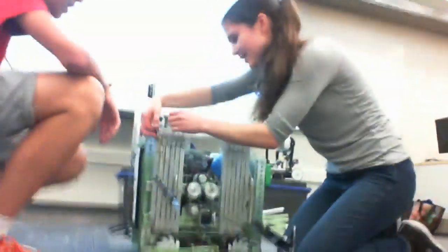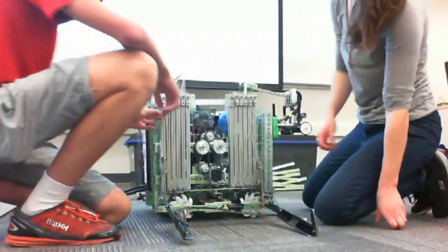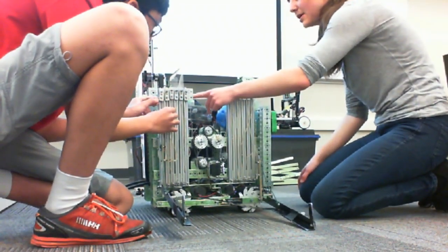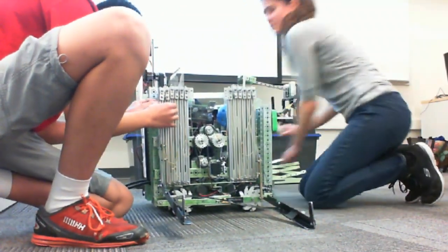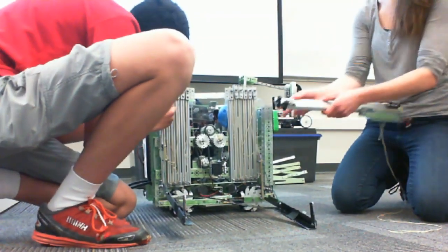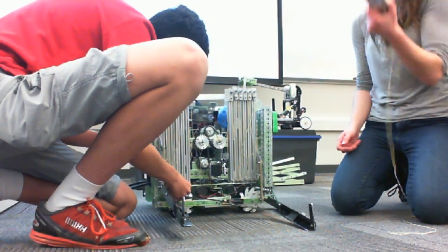Adjust the camera. This has gotten caught between the pulley and the side end. But most string things now have the caps, right? Yeah, so this one, as you can see, we got our own ball bearings, and we made our own little cages for it to keep it from sliding out. We tried 3D printing the bearings, but they had too much friction and didn't work very well. REV now has little bearings with cases on them. However, that's what I was mentioning: make sure you have string that fits inside of it.